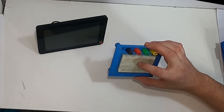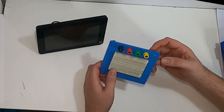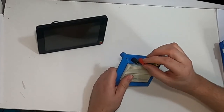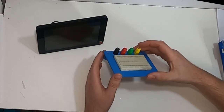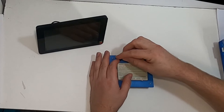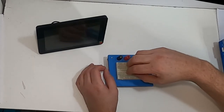Then the breadboard. This breadboard is mounted on a breadboard stand which I designed and I've created a separate video on this showing how it's created in Tinkercad. The main benefit of this is these 4mm sockets which can be used with banana plugs. They're not really needed for this circuit, but they can still be useful for testing purposes because you can connect these to a multimeter. But they're not really needed so if you wanted to just use a straight breadboard that would be absolutely fine.